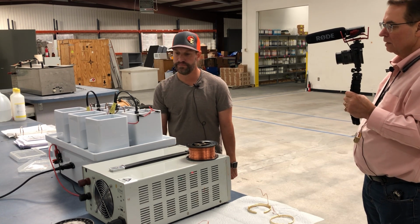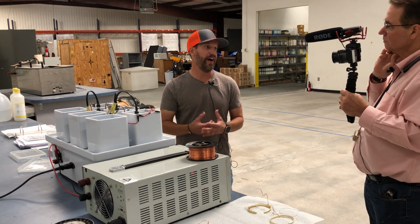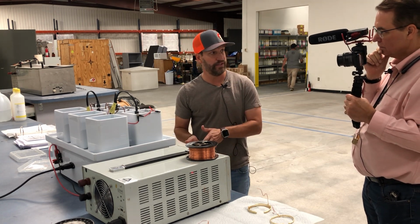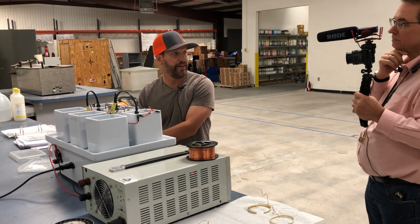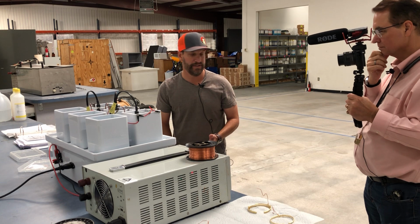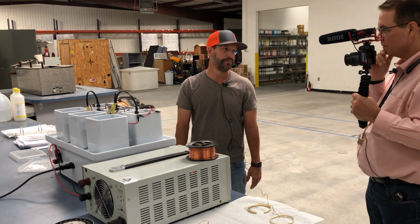And the neutralizer acid, what's the name of it? It's called neutralizer, but it's a 5% mixture, and so basically it's very mild. You asked a question earlier about what can go down the sink. You can neutralize the electric cleaner, the degreaser, with your neutralizer. Verify that for sure, because I don't know much about the one that you have. But for us, we know that the purpose of this acid is to neutralize this and to set that surface. If we go to a trade show, you can mix those two together and they'll neutralize each other out. But I wouldn't do that with the plating solutions.